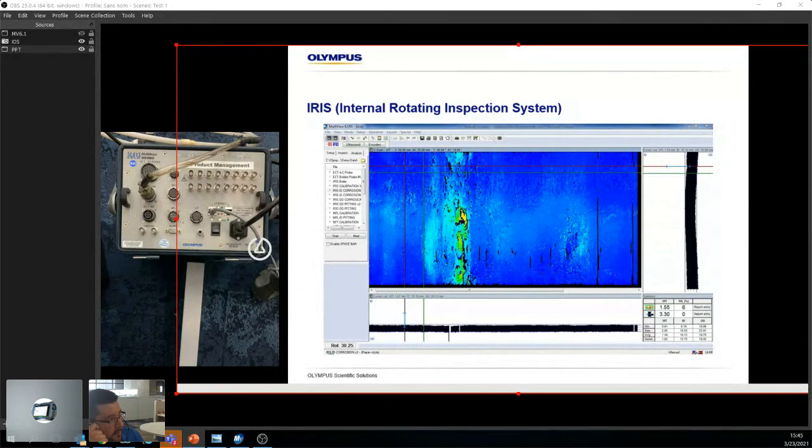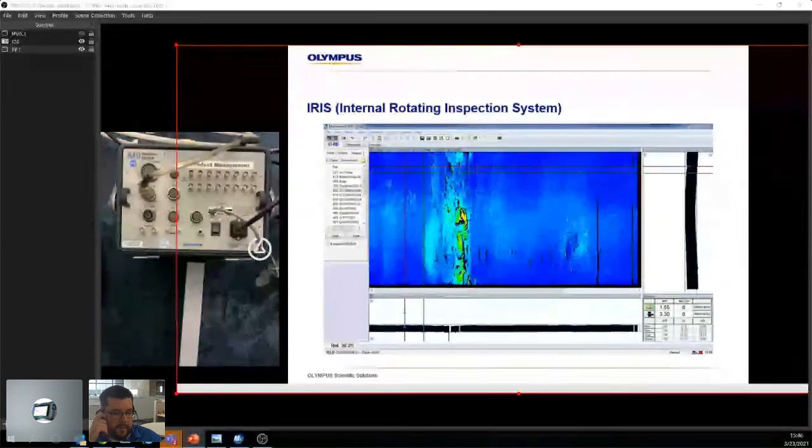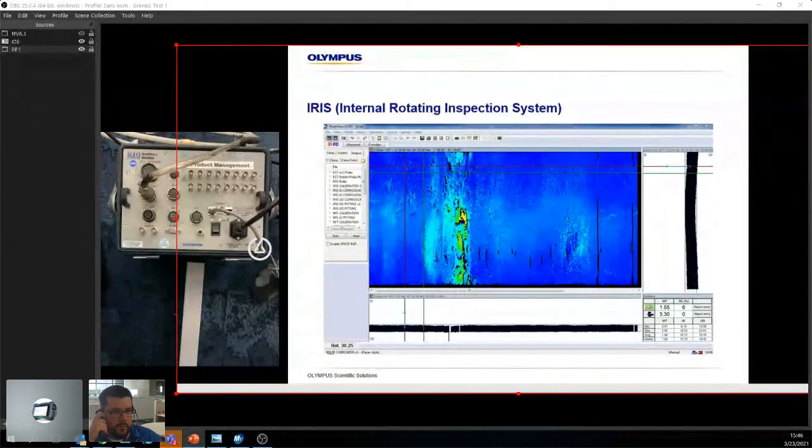Remote field. One of the biggest problems with remote field is that it's hard to analyze. If you're using a TRS probe, it's not too bad. A TRS is a single exciter, and a TRX is a double exciter. In the TRS, you have the head and shoulders, which is easy enough to see. But if you're using a TRX, you have head, shoulders, toupee, and then everything goes back down, right? So there's a lot of information.